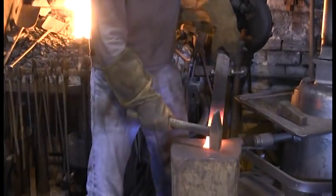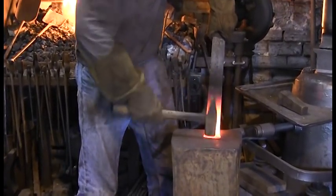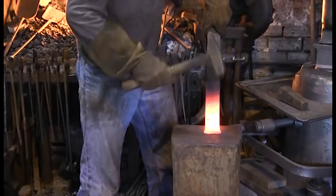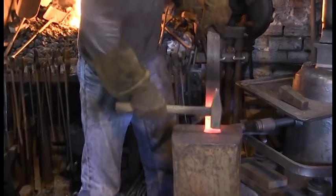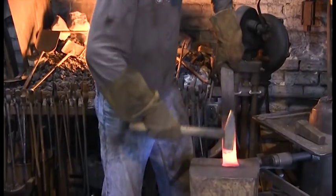Carter is trying to apply the lessons he learned at the anvil on his first 2 heats. He is trying to hit the edge of the bar. In deep concentration, he has tightened his grip even more and almost completely stifled the motion of the hammer.